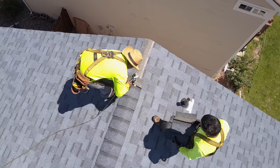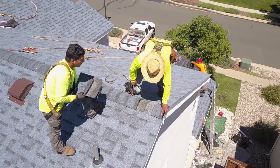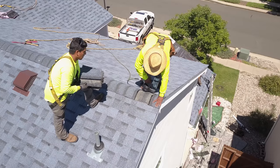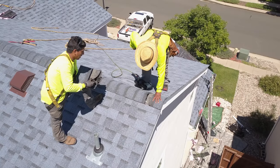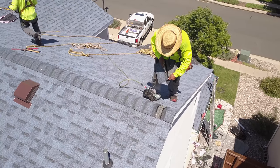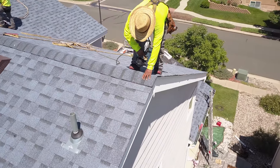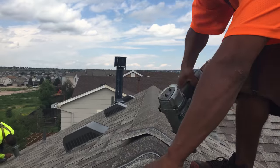We're coming to the end of the gable. At the end of our ridge cap run, you'll see us skipping about a foot and starting another ridge cap shingle coming in from the opposite direction. We have one set of shingles installed moving west to east for about 53 feet, and then about two pieces running east to west in the opposite direction. We're terminating the very top with a cap where those two directional shingles meet. Install your starter strip first, then the ridge cap shingle second.